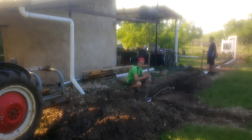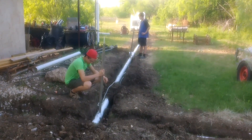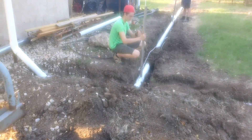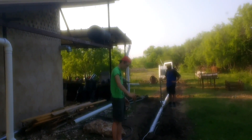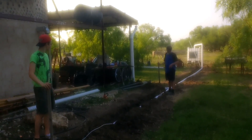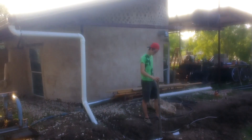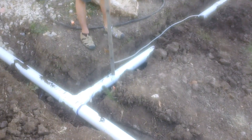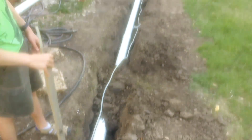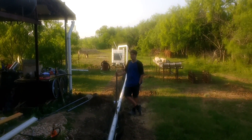Here's an update on our progress. We've just completed most of the rain catchment system. We've got four-inch PVC in the ground just below grade going up to our two gutters — one on the front side of the house and one on the back. Rain will come down the four-inch pipes into a joint, then into one four-inch pipe that runs from the front of the property all the way back into the tote, which is just one of several we're planning.